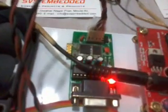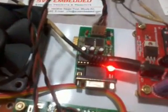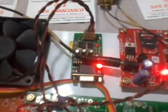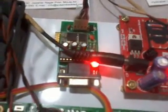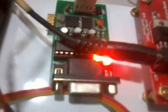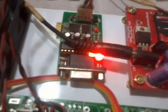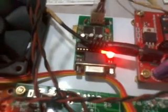Here I used one Bluetooth module, BTM005. First of all, when we want to connect a Samsung or Android phone, we have to download one app, the Bluetooth SPP app. When the app is downloaded, we have to pair with that Bluetooth module, using the password 1234. When the connection is established, the green LED, which is continuously blinking, should turn off. After that the data will be received in real-time mode, and we will get the outputs continuously.